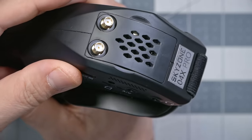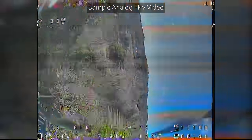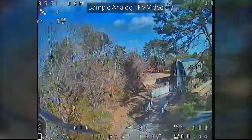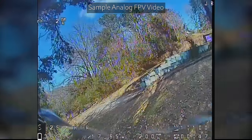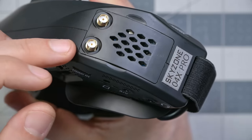The first thing you've got to know about these goggles is that they are first and foremost analog FPV goggles. They come with a SkyZone analog receiver module able to receive signals from analog FPV video transmitters and analog cameras. The signal is going to look basically like television in the 80s or 90s — less resolution, and the signal break-up is analog in nature. We will be going outside to fly them to test the SkyZone module's performance, which historically has been pretty decent, though maybe not absolutely the best analog module available.